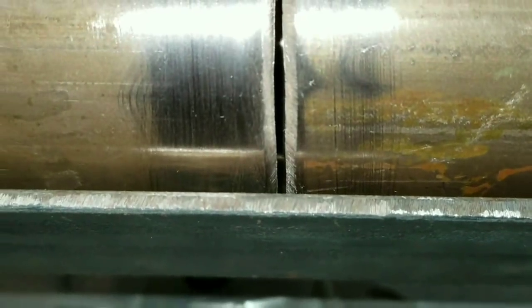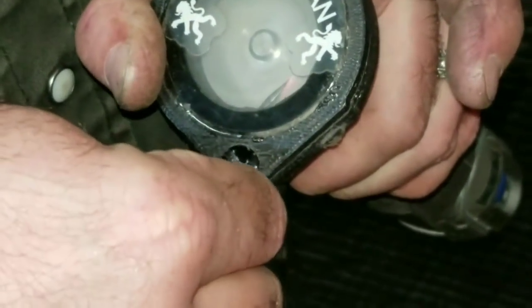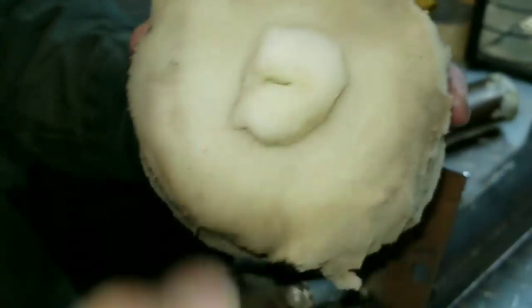Here's a picture of our end cap for the purge and our root opening — the gap is about a sixteenth of an inch, with pretty steep bevels. Make sure you keep your tungsten sharp; the Scotsman tungsten sharpener works real well for this. Here's how we put the purge in — don't just throw the hose inside the pipe. You want something on the end to diffuse it. Also clean your wires with some Scotch-Brite — everything has to be real clean.